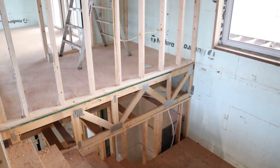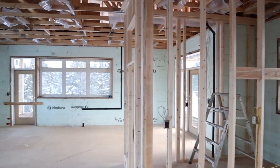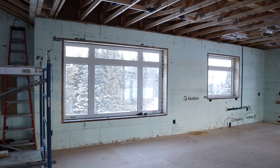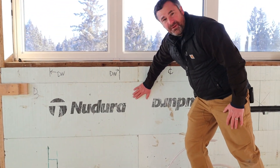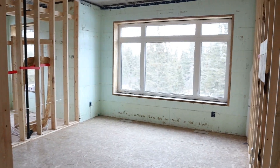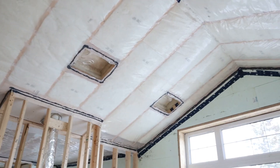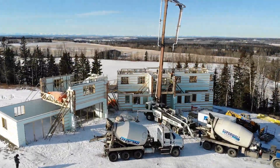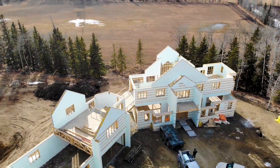When you carry ICF all the way through, you have continuous insulation from the foundation to the roof. You don't have a floor system interrupting it and creating cold transfer. The foam behind me — we're actually filming at minus 15°C right now — doesn't feel cold at all, because everywhere you see ICF is insulation. More efficiency, stronger, quieter, up to 10 times more airtight. You get all these benefits in one system, and once you do it once, all those characteristics are done.